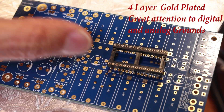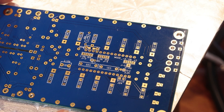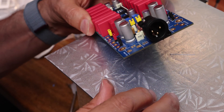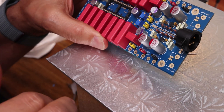I spent a lot of time fine-tuning the output stage on this DAC and also the design of the DAC. This is a four-layer board, not a two-layer board. It's almost like a surface mount, but I actually made it through-hole. For all of you who are not highly experienced — and I used to be one of them — I know the struggle of trying to solder those pesky little tiny capacitors that barely measure one millimeter. It's a lot easier to solder, so almost most people can solder it. There are a couple of things like the OPA861 chips that are surface mount, but 95% of the DAC is through-hole — through-hole in a tight version, in a four-layer design, so it keeps all the characteristics of a surface mount, yet it is through-hole.